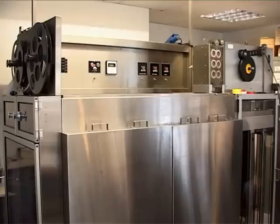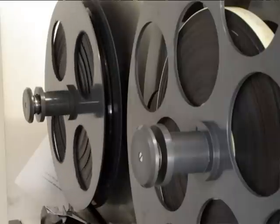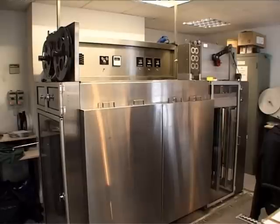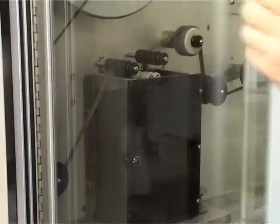For film re-washing, the film is loaded onto a purpose-built dual gauge re-wash machine and run through a re-wash bath. This causes the emulsion to swell. When the film emulsion contracts again upon drying, any fine to medium emulsion scratches will close up. This process is more effective with thicker emulsion stocks, usually colour. Following this process, the film would be ultrasonically cleaned to remove dirt and dust prior to polishing or transfer.